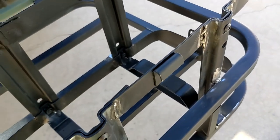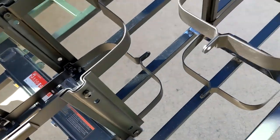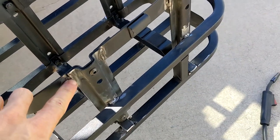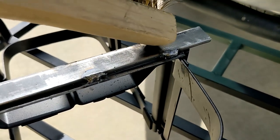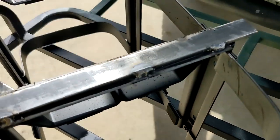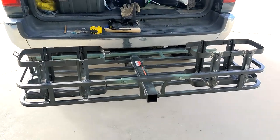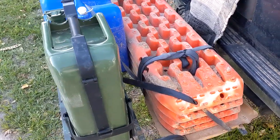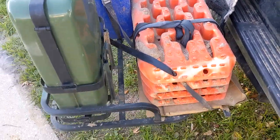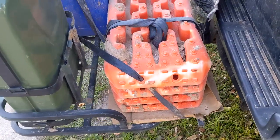I tacked those because of a review I read about tack welds breaking and not relying on just the screws. Then I realized I've got red Loctite here, so I'm just going to Loctite these screws — save a ton of labor and avoid as many potential rust points. This is my second project ever welding and I'm getting a little bit better on settings and technique. Got the dual can set up and coming along. One-month update: driving cross-country and back and three weeks in Baja on some pretty bad roads — overall I'm happy with the hitch carrier and the mods.